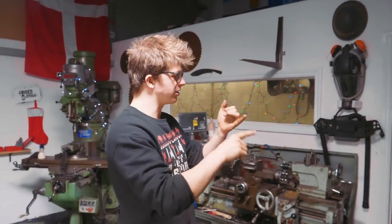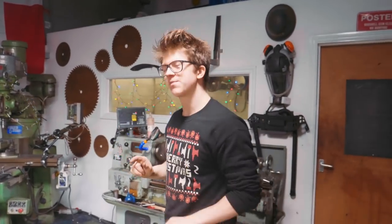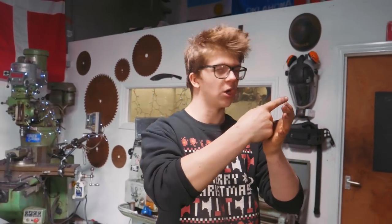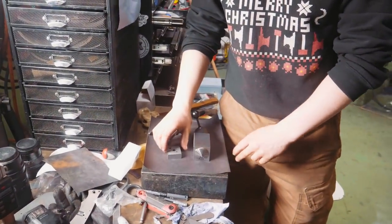So we have now, today, turned two washers — little thrust bronze bearing type things. We have also turned the actual pivot itself, which has a four millimetre thread going the whole way through. We've also turned the stopping pin out of steel — four millimetres in diameter with a three millimetre thread going the whole way through. We then made ourselves a little fixture up in the mill, drilled 0.2 millimetres shy and then reamed three holes to make this block of steel, which I used to hold the parts flush while working them on 400-grit sandpaper on the granite block.